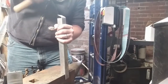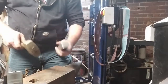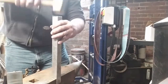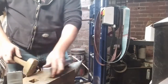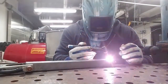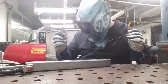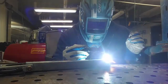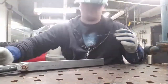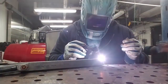This is the same kind of vessel that you would make if you were making canister damascus, and a lot of makers will cut a plug instead of folding the edge over. It doesn't really make a difference — I always thought cutting a plug was a lot more cutting and fitting. It welded up really nicely. Ordinarily I would use a MIG for this, but the MIG machine was in a different area of the shop, so I was stuck with the TIG. When the metal is all clean, it welded up beautifully, even though I was just using a piece of bailing wire as filler material.